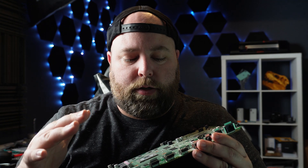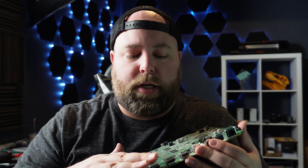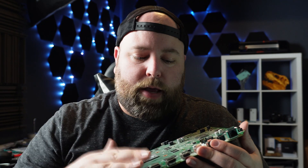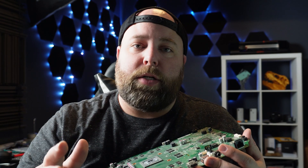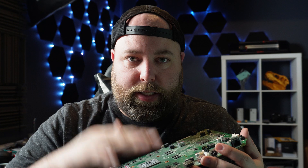For those of you that are wondering, my favorite method is to extract the HDMI with heat and, while it's still hot, install the new one without having to add any additional solder. You may have to add additional flux, but if you do it just right, you can actually lift it off and put it on. It's a little bit more complicated than that, but it's much easier than the entire process we just went through once you have the skills to do it, and you'll understand why as you do that.